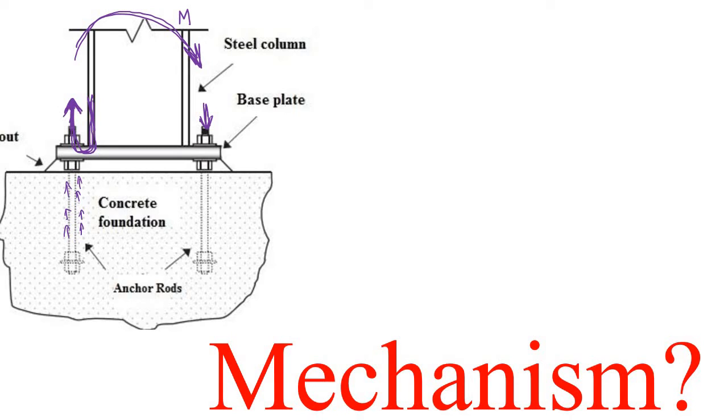But the bond strength, let's say this is the anchor bolt, the bond strength simply prevents this coming out of this bolt, the friction or the bond strength. Then what will happen? This whole tensile force is transferred to this end plate, whatever it is. Let's say you have welded this at the end of the bolt. Now what happens? This whole plate tries to come out like this.